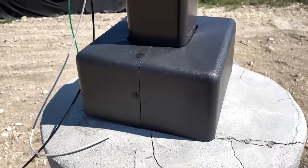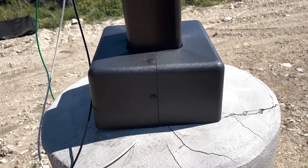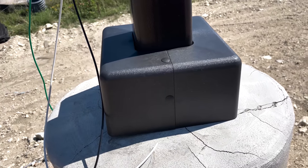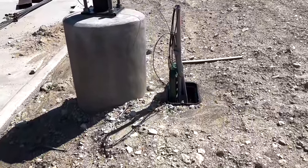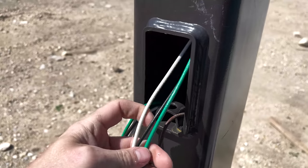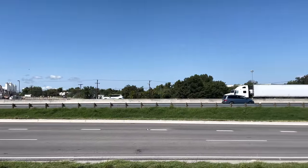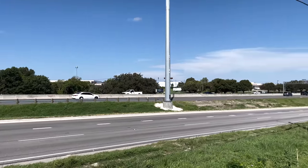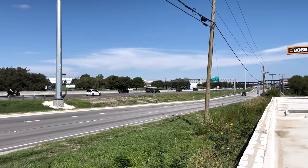Then there's always a plastic set of base covers. On these poles you put these little plastic covers so everything is nicely covered on the bottom, and then there's usually a cap you put on the top. Next we got all the underground runs between each pole wired. The property isn't ready and there's no actual power there yet, but because this is alongside a busy highway the builder asked us to get these on temporary power with a photo cell so the site is lit up at night — they keep having problems with people driving by and stealing stuff. So we got everything wired and ready to go. Now we're waiting for the meter to get set on our T pole so we can actually energize everything and get these lights burning.